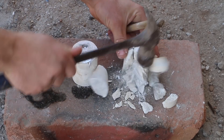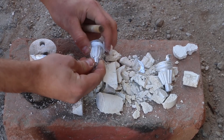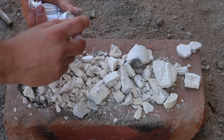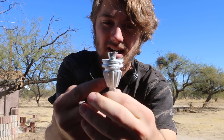The pours are done on all of the pinions — let's break them open. Oh yeah, wow, that's beautiful. But this one's shrunk — look at that, what happened there? I've poured probably over 30 of these parts and they've all come out like this. That's great and all, but it's the wrong part — I need them oriented the other way. This isn't a perfect replica and it still has issues, but this is about the best pour I've gotten out of the 30, and it's still not good enough to use in my aluminum chuck. I need to find another method.